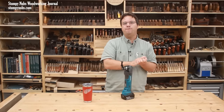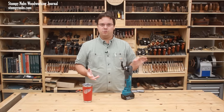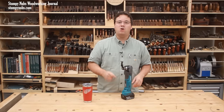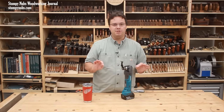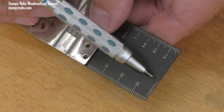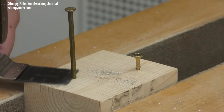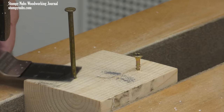If you're just cutting soft non-ferrous metals like aluminum or copper, pretty much any metal cutting blade with fine teeth is going to do the job. But bi-metal blades will also cut iron and steel, so while they're more expensive, they can cut more materials. Bi-metal blades are also often used for cutting wood that's likely to contain metal, such as nails. This isn't a perfect solution because bi-metal blades usually have fine metal cutting teeth, so they cut slowly and build up more heat in thick wood. But that compromise in speed may be worth it if you think there's metal in the wood. Keep in mind that while a bi-metal blade will cut through a nail, drywall and construction screws can wreck them pretty quickly because those are much harder.